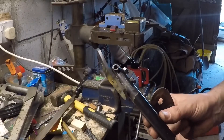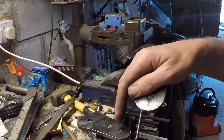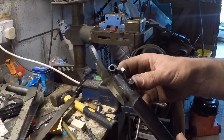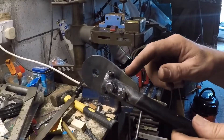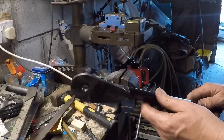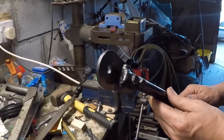The skid's all shone up now and I've bolted it through the arm — used a couple of new BSF bolts. The old one, because it was slightly thinner, the bolts stuck through slightly and I peened the top of the bolts over. This one I'm not going to be able to do that — I don't want to put centre punch marks, I want to be able to use the bolts again — so what I did whilst you weren't watching was I drilled the heads of these bolts with a 1/16th drill. They drilled fairly straight — they're pretty good anyway. Once I've given it a squirt of rattle can black I can wire lock these bolts together so they won't come loose. I'll give the other bits a squirt of paint too and then put them back on the aircraft. I'm very pleased with that — that's quite a nice job. Anyway, if you're still awake, thanks for watching, see you soon.